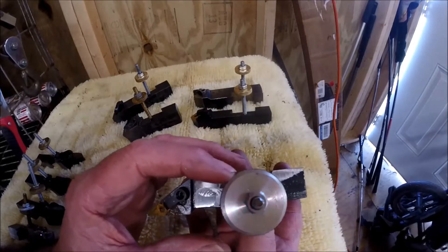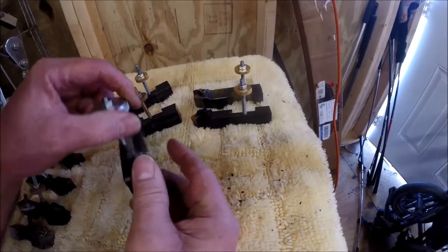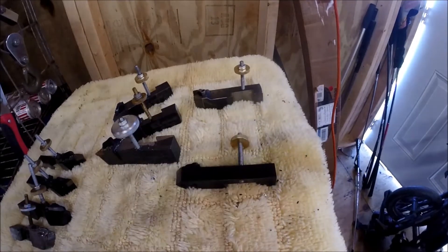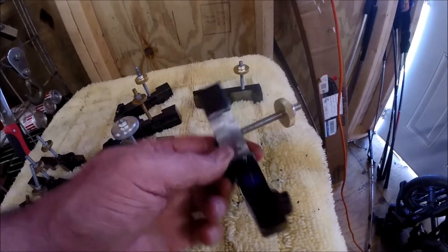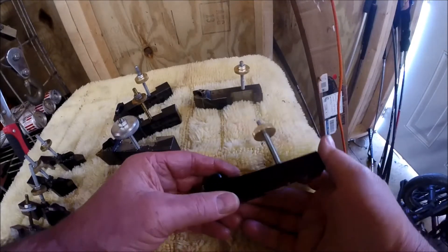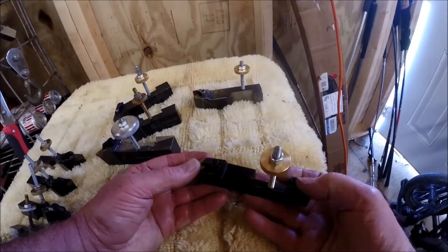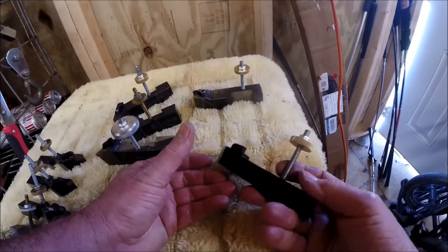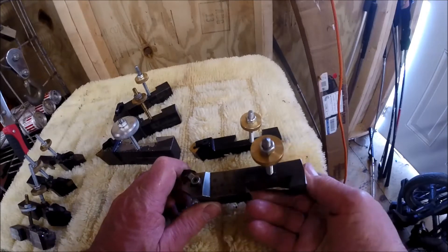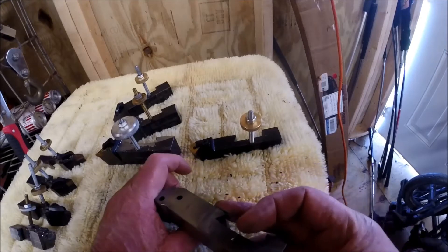I had this one made up, but it's still the same principle — direct mount. I bought this tool on eBay and showed it a couple of times. I'm using my welding table, by the way. I did this one this weekend — it's just a SNMG holder and it's a three-quarter. I'm going to use this for chamfering. And then this one here is a left-hand — basically a gift to me, maybe from the trash at work or something.